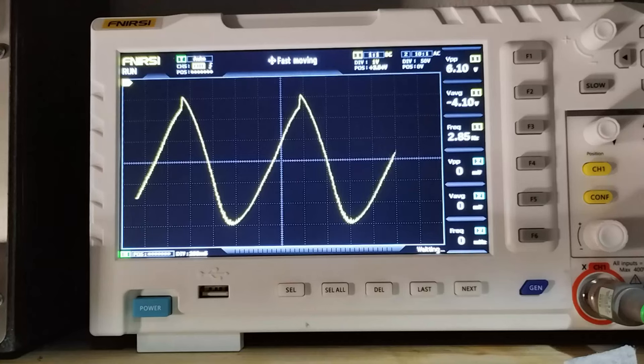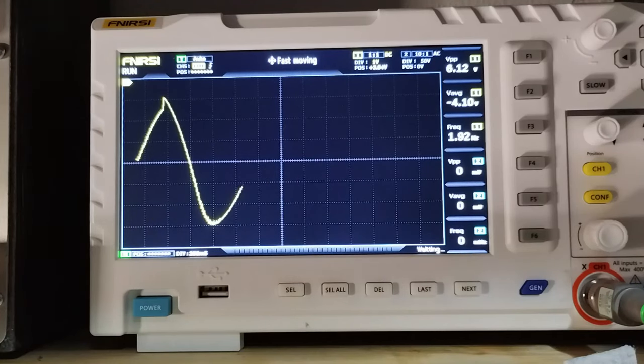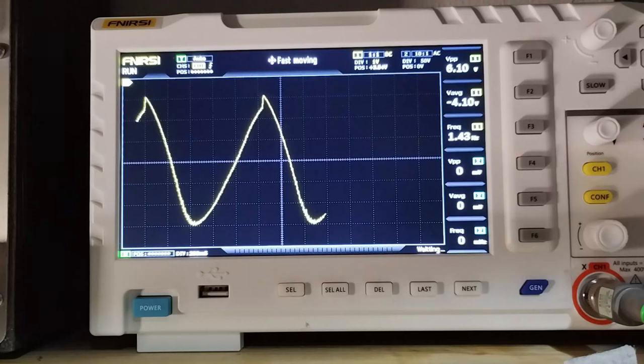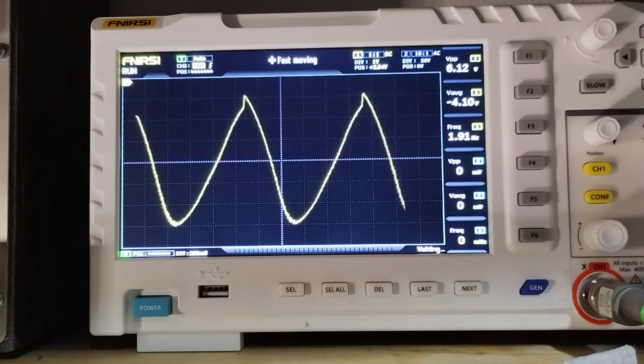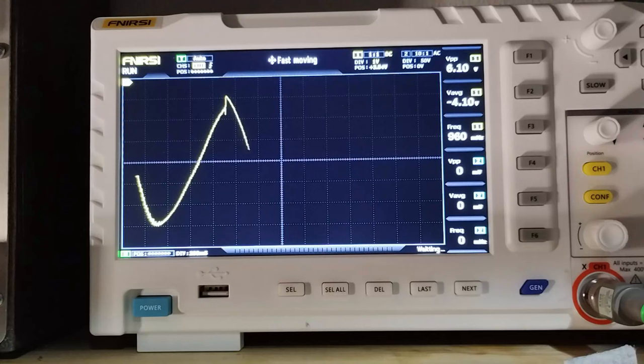The result was what is visible in this clip, and later also the exact frequency of the peak was verified to be better centered to 468 kHz as prescribed. If the signal generator is not able to provide a synchronization signal to the oscilloscope, the peak frequency should always be verified after the visual alignment.